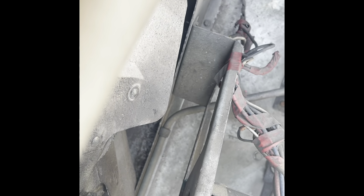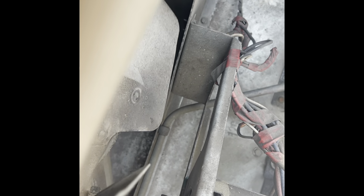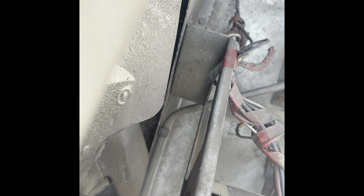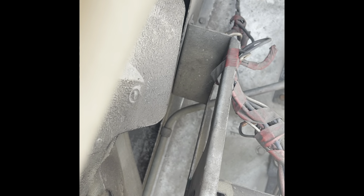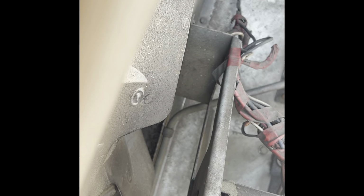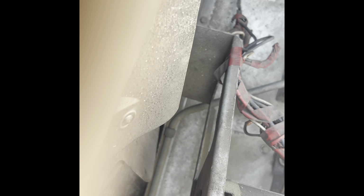You got one blade. All right, watch this. I'm gonna put this right here. When we spin this, you see it? You got one blade that's in a very different place when it comes around. That one. Look where it is in reference to this bar right here. The other ones, right at the tip of that bar. This one's actually inside that bar a little bit. All right, this one. We're watching this line. There. That one's angled in. That one's angled in even more. This one's angled way the heck out. Bending fan blades is a terrible idea. Don't do it.